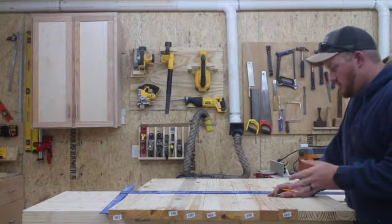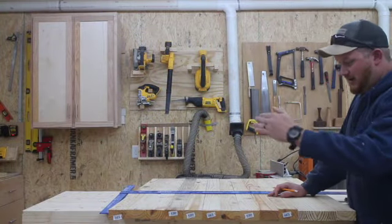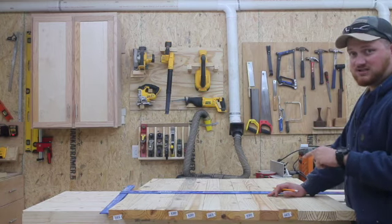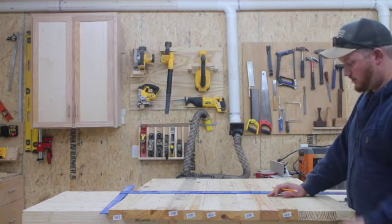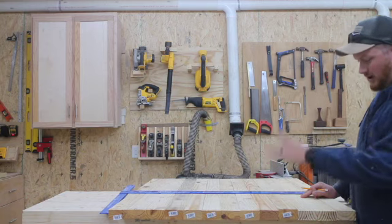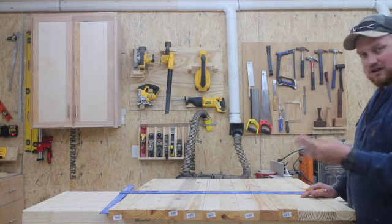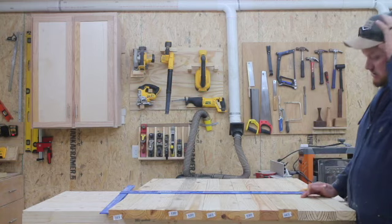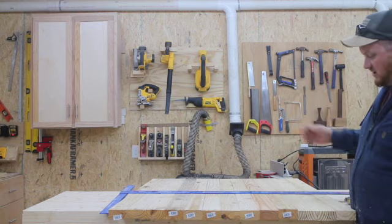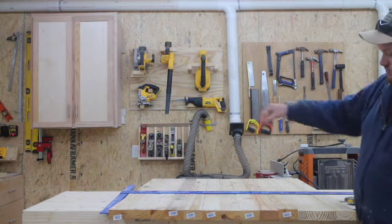All right, I now have all the 2x4s cut and laid out. This table top for the coffee table is gonna be a 36 inch circle, so a 36 inch diameter. These are each 3 inches wide. I added one more, so I have 13 total, so it's 39 inches right now just to give me a little extra room. And then they're 4 foot long, again, just for extra room. I'm gonna biscuit joint all these together.